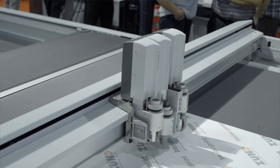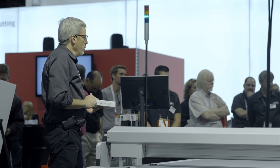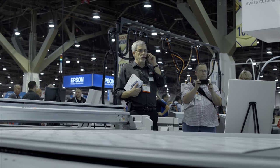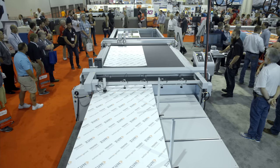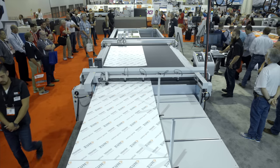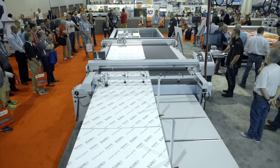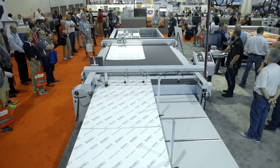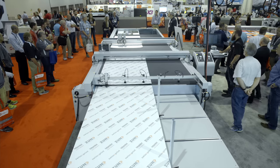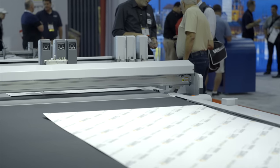Many of our customers are up around 95% green. Now you can see the machine is done cutting, and you're going to see another Zund patented process. While it's feeding another sheet, it's going to deliver this finished board onto the stack. Zund has a way of delivering — we are the only people to do this — we can deliver this board with no bridges to hold the product into the waste. Notice how it gently drops the board onto the stack.